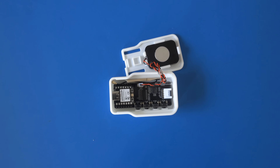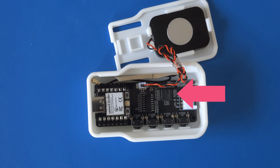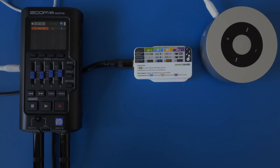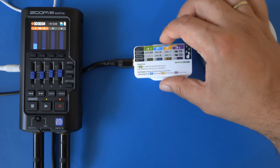This is the hardware: you get an ESP32 C3 microcontroller, the SAM2695 synth-on-chip, an amplifier, a Wi-Fi antenna, and four buttons. The default firmware lets you start a simple drum pattern and switch through patches and play notes on the two middle buttons.